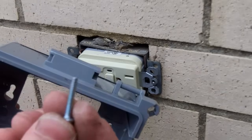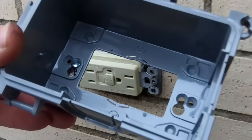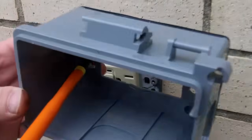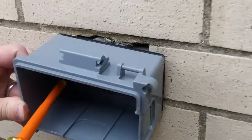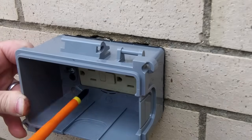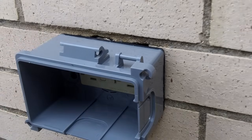The first thing you want to do is take your outlet screws. You'll have to take them off if you already put them on, but you need to put them in the box like so. I take a screwdriver, hold that in place, and then simply put the screw through the outlet cover through the GFCI hole, and you're good to go. You do that for the left side and for the right side.